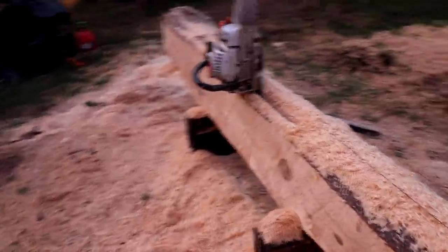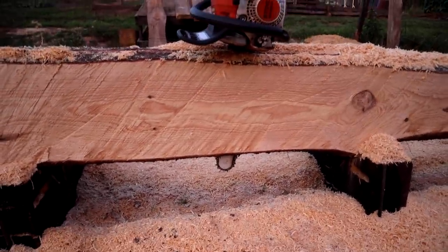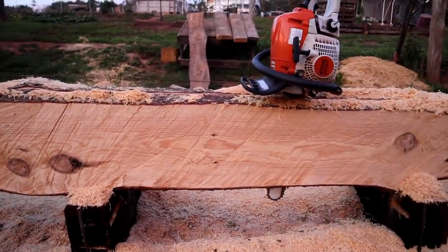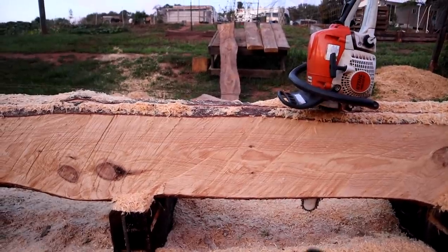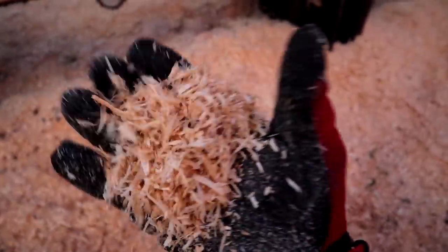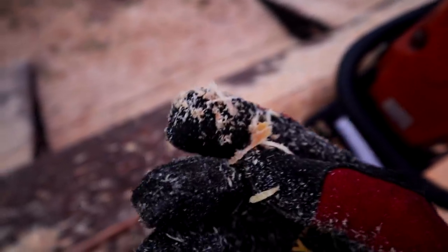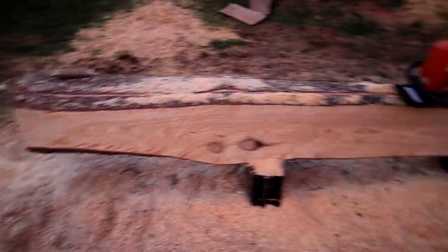Since I'm running out of light, I figured I would show you where I'm at. That is all the bar I've got — you've got to work with what you've got. You can see the angle I'm working at. I like to go forward even though you run the risk of having the chainsaw want to buck, but it kicks the chips behind you. One of the things I've found is watching the chips: if you have nice big long chips, then your chain is nice and sharp. If you start getting powdery sawdust, the smaller stuff, that means your chain is dull. It's a lot easier to work with a sharp chain — way easier. I'm going to pick this up tomorrow.